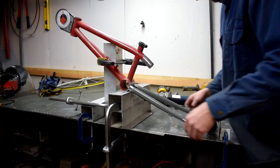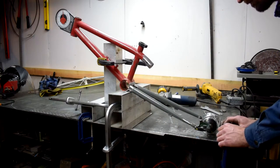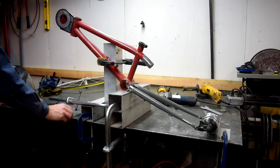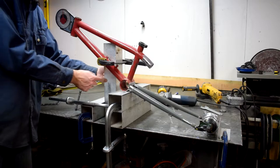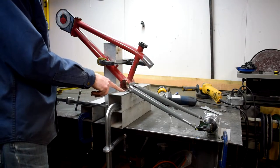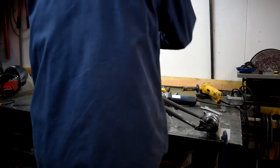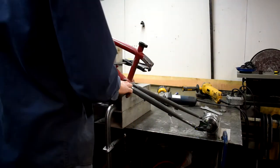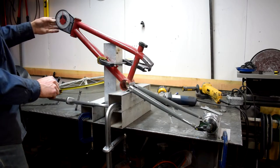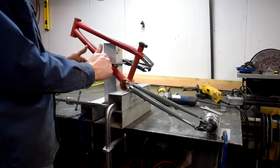Things got a little carried away between the last cut — I'll do my best to explain. I've got the bottom bracket drop set up and have squared up the rear axle to the front edge of the table. The aluminum tube is squared up to the front edge of the table as well, and the upright aluminum tube is square to the top of the table. The last thing to check is to make sure the bottom bracket is flush with the tubes so the frame is perfectly vertical. Whoops — it's totally not. Let me just fix that. There we go, that's better — it's evenly touching the aluminum on both sides. I know that it is flat and square to the table. I also got this magnetic angle finder up on the head tube to check the degrees. Stick it on the front, make sure we're at 68 degrees. Everything looks good. Let's tack it in place.